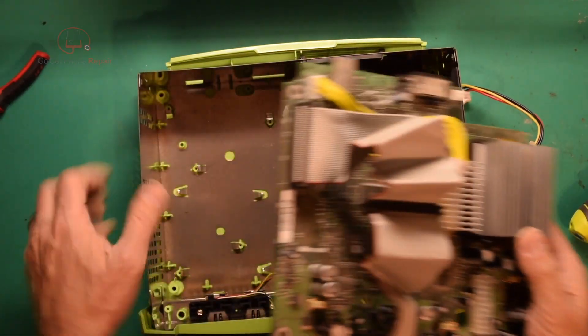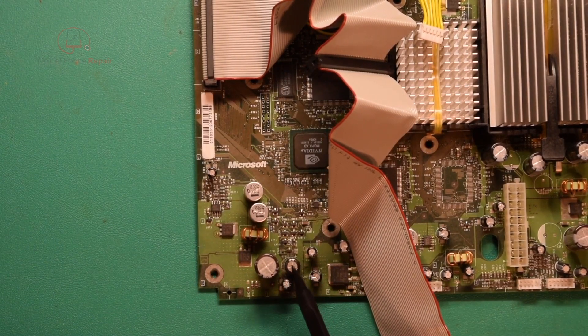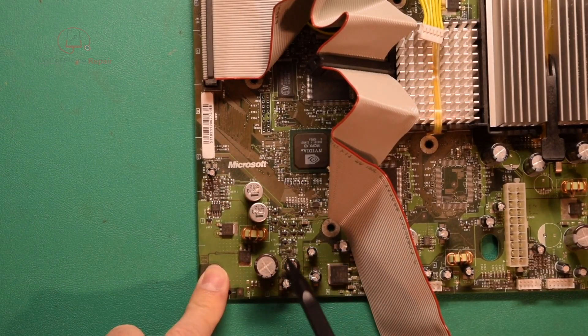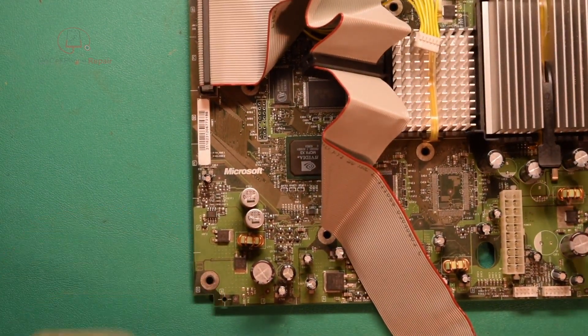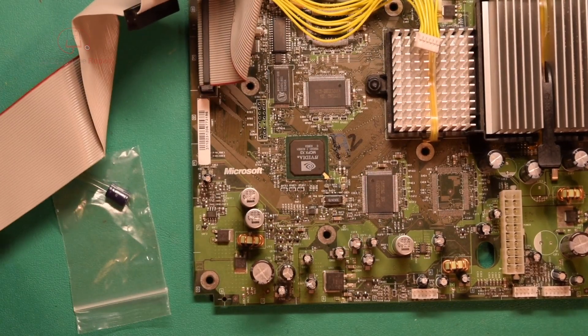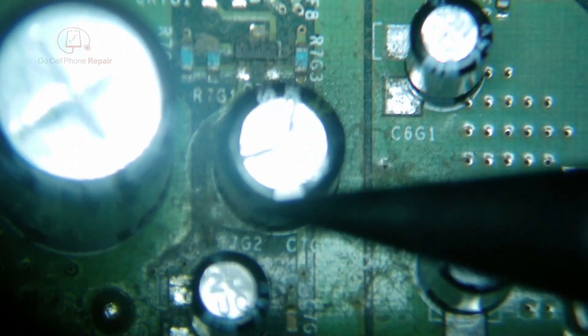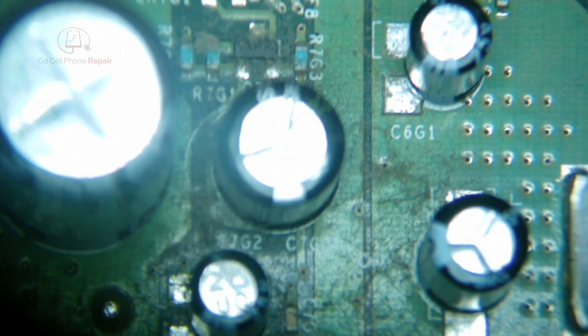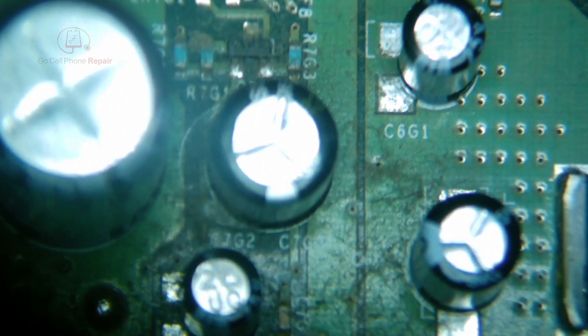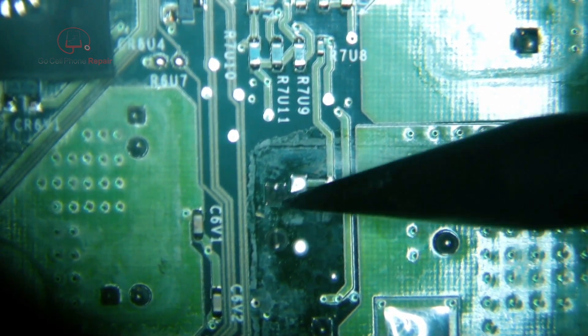Now up and towards the front, and here is what we are after. What we're looking at is this guy right here. I've removed these before and they've made a big mess on the motherboard — this one doesn't look terrible. Since it's not keeping time, it is time to upgrade. So we'll get this under the scope, swap that out, put it back together, and we'll be good to go. We're going to flip it over and use the big iron. You can use a solder sucker or whatever works, but I find that a wick is actually sufficient to get this done. Basically we're going to clear these of solder.